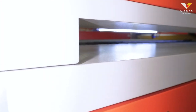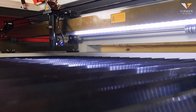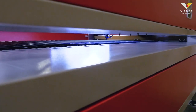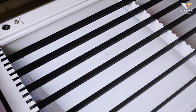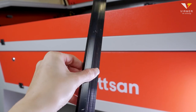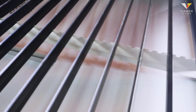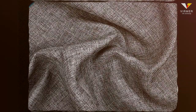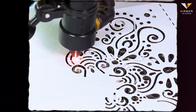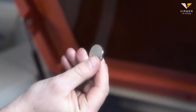The machine is equipped with a through table, allowing you to feed materials of a greater length than the work table, as long as they are no wider than 1600 millimetres — a feature that speeds up the production process. Anodised aluminium blades are included in the complete set, preventing the laser beam from backfiring. If the blades are painted rather than anodised, soot will occur when cutting plywood. You can also purchase an optional honeycomb table, essential if you are cutting fabrics, furs, leather or small parts made of solid materials. Watson honeycomb tables are metal, allowing you to press materials with magnets.